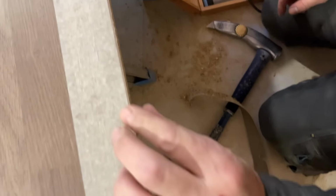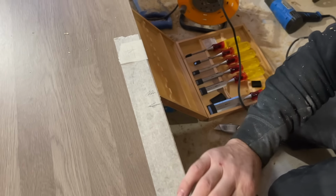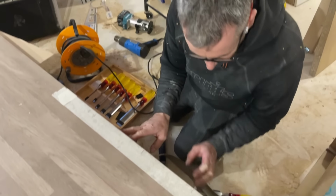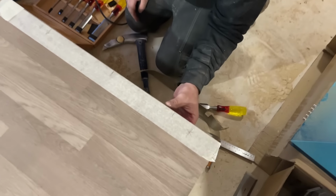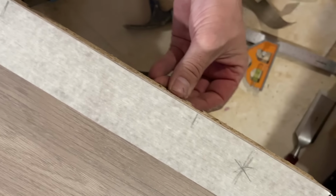You can see there, that's a lovely finish, is that? So that should go together lovely, but we'll see. It's the benefit of having these square edge worktops. What I might have to do is just sand that. It's a little bit coarse there, but what happens sometimes, it just does pull anyway. You know, because the glue's obviously pulled the fibres up, but I might just sand that.